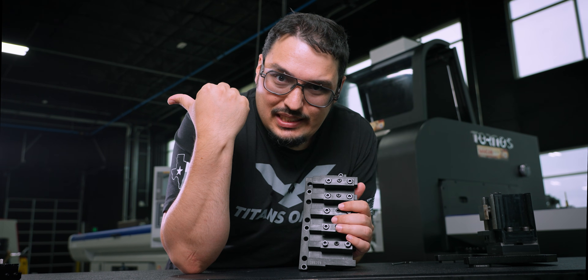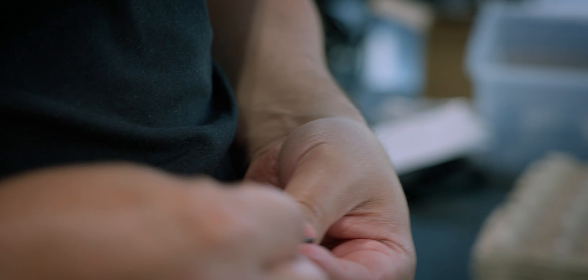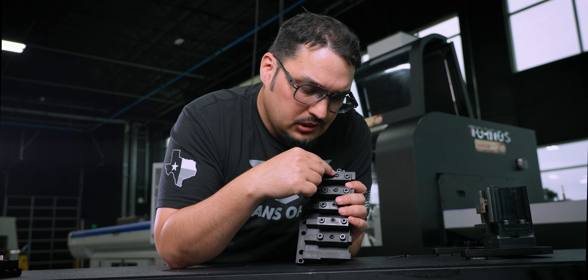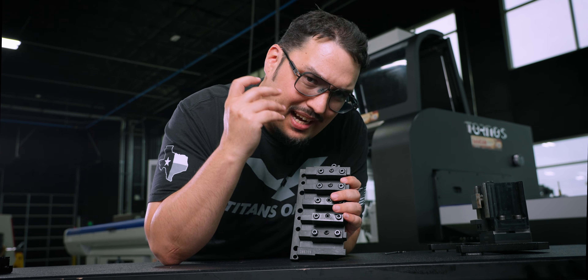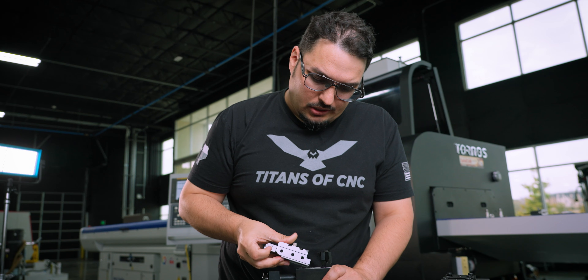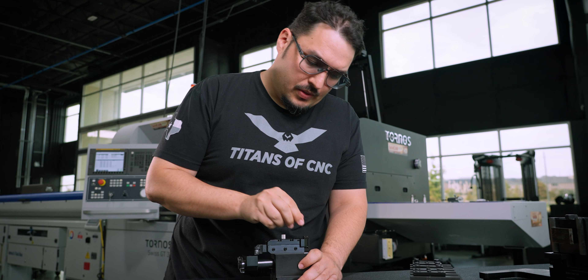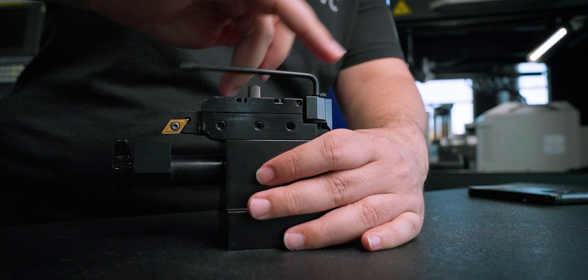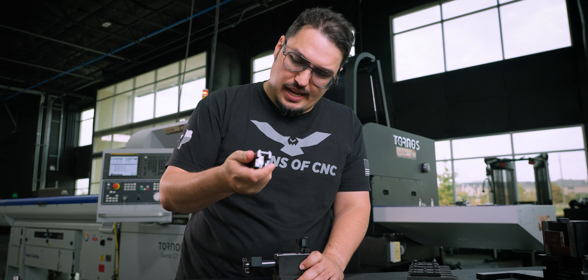If you need to change an insert and they're too close together, you have to figure out a way to get the tool out. On the DT26, I've got Kennametal tools in there with quick change heads, so I'm able to remove them, but that still takes some time. Usually to get them out you have to undo these center set screws, which will release the tool, and that takes time. With the Goulton Bolt ones, you just pop it in there, tighten down the screw, and you're good to go. When you need to take it out, even after running it for hundreds of hours, you just pop it out — comes out with the handle.